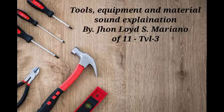Next, let's explain what a circuit breaker is. A circuit breaker is an automatically operated electrical switch designed to protect an electrical circuit from damage caused by excess current from an overload or a short circuit. Its basic function is to interrupt current flow after a fault is detected. Types of circuit breaker. There are three basic circuit breaker variants: standard breaker, which includes both single and double pole circuit breakers, the ground fault circuit interrupter circuit breaker or GFCIs, and an arc fault circuit interrupter circuit breaker or AFCIs.